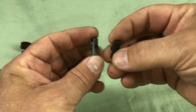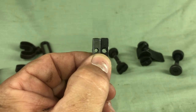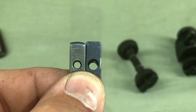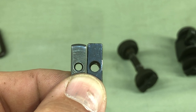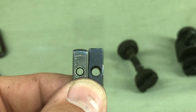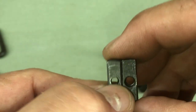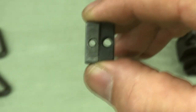Once they went to the lock bar system, I'm going to show you the differences between the bars themselves. If you look at the top, the one on the left is rounded while the one on the right is squared off. The left is type 2 and the right is type 3. The holes in the center are different sizes to accommodate a solid pinion versus a peened-over pinion.